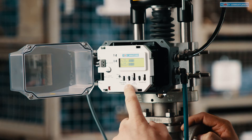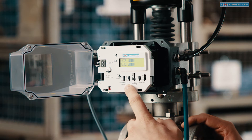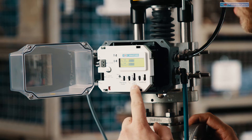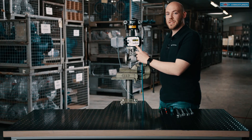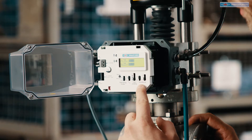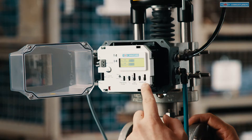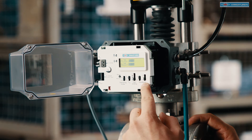The second button is used to change the characteristic to inverse linear or to linear. The third button sets the tight closing point of the actuator. The dead band can be set to fixed or automatic, whereby the button on the right side next to it sets the fixed value.